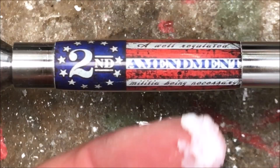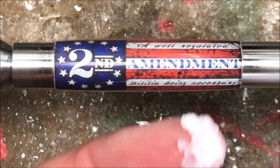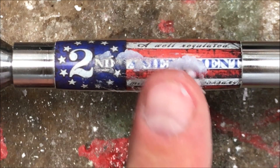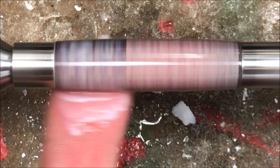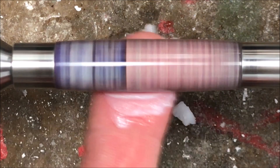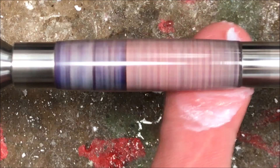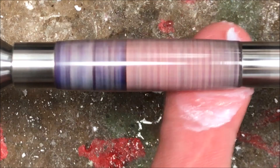I've got my Renaissance wax and I'm just going to apply it by hand — this is way more than I need, but it's what came off the tub when I stuck my finger in. I like using my finger because there are no abrasives. If you polish down with micro-mesh, you're taking it down to 15,000 grit. If you use a piece of paper towel, that paper towel has a grit associated with it, and that grit could put scratches back in the surface of your blank. Your finger has no grit, so when you rub this wax into the blank, there's no possibility of scratches whatsoever.